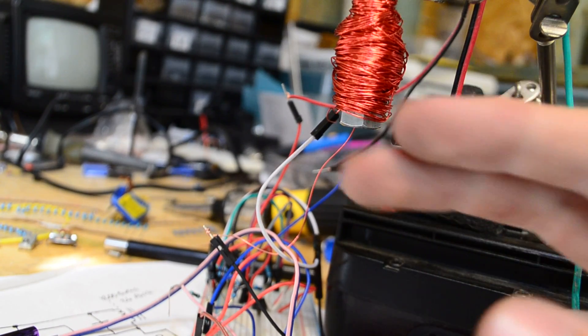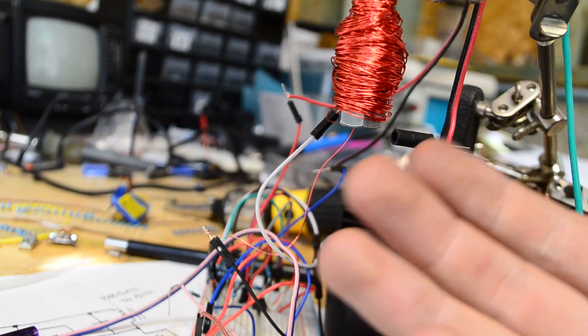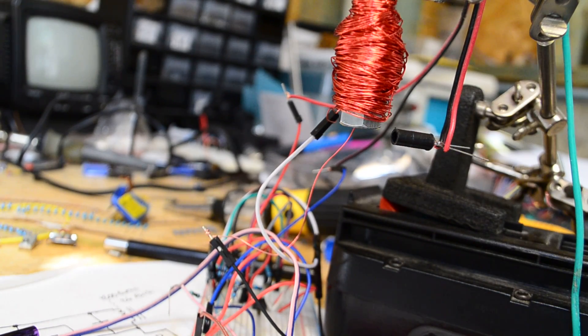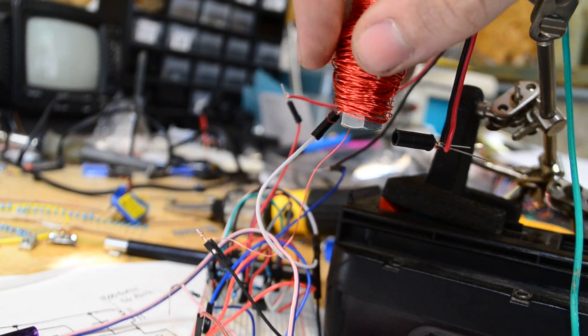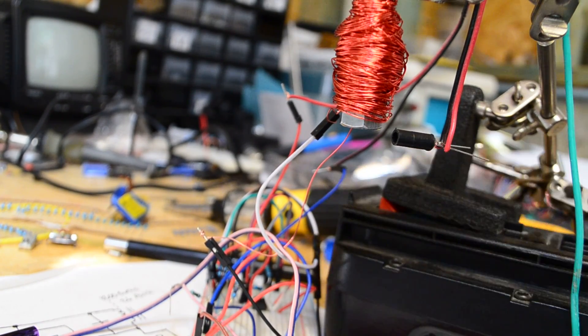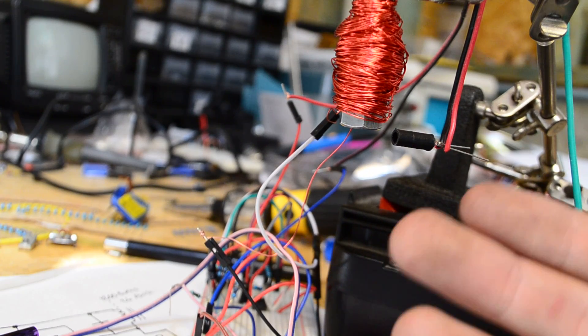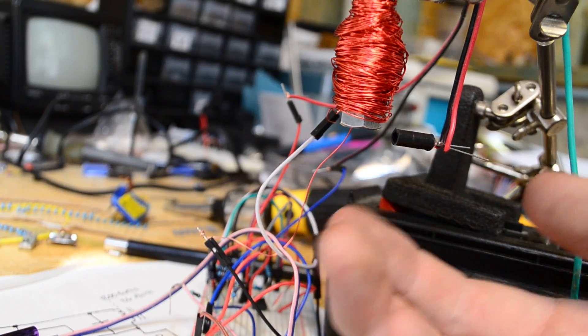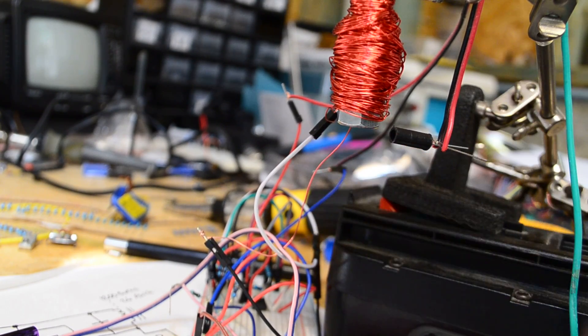If you wanted a better electromagnet, you could put more turns on it. However, another way is to apply more voltage through it. Using something like a microwave oven transformer with the secondary coil removed, you can get a very strong electromagnet. For that, you'd want it to have its own separate voltage going into it, with just a common ground shared with the other 12 volts supplying the rest of the circuit. This way, you wouldn't have to worry about the increasing heat dissipation from all the resistors. So that's probably what I'll plan to do in the future, since this is more of just a proof of concept project.